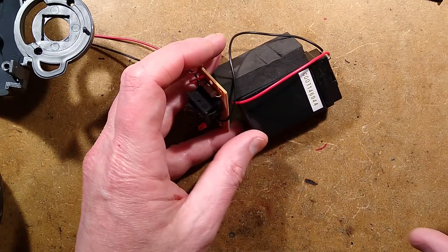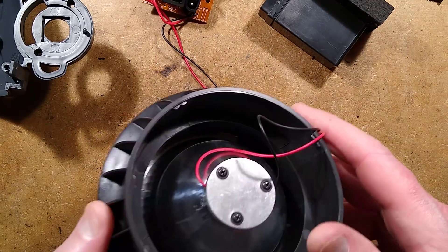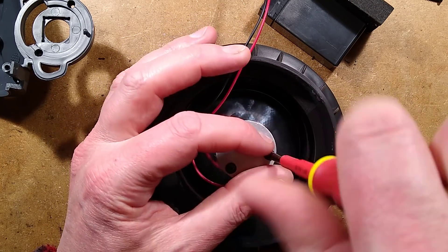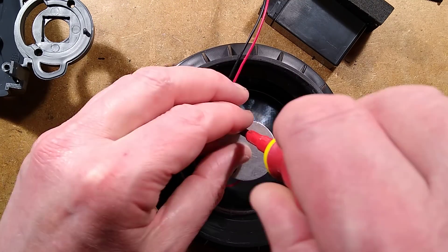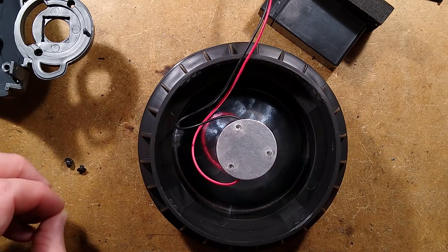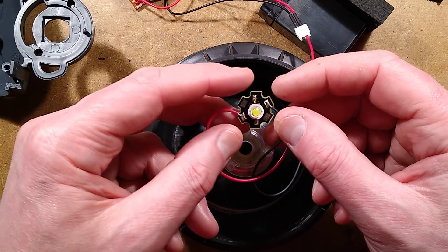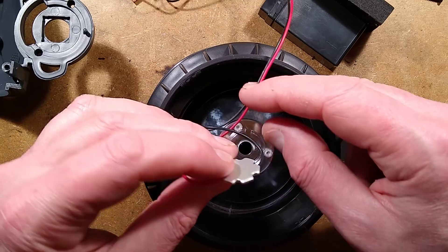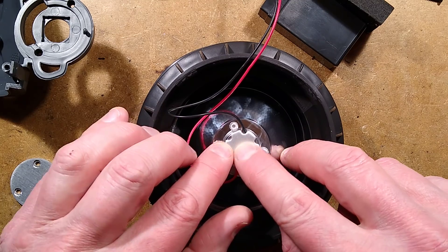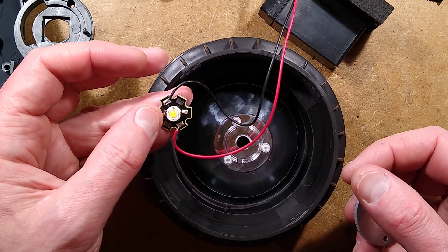As the battery discharges, current will go lower and lower. It's a very simple circuit, and it's a tiny battery in a huge big case — they could have fitted so much in there. If I take this off with a screwdriver, I expect the LED to be mounted directly in the back of this. What it reveals is a little aluminium heat sink plate with recesses that go onto pins and squish down onto what is a Luxeon star-style LED in the standard dimension. So you could just pop in your own LED here, which is quite nice. A dab of heatsink compound would have been nice, but it's only running about one watt so it's not that significant.